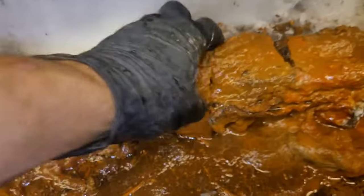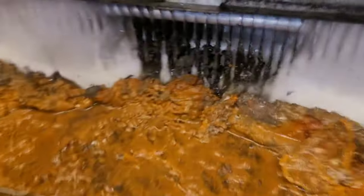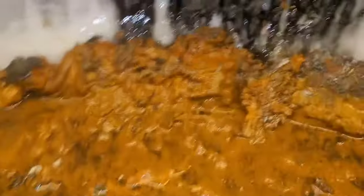You've got to defrost the whole case. Once you get the ice off the top, you take the top off. I'm going to shut all the motors down. I also shut off the liquid line solenoid valve up at the rack so you can defrost all this. Of course, you want to make sure it's draining properly. This is an example of years of neglect — look at how dirty this is. This is what happens when you don't take care of your equipment.